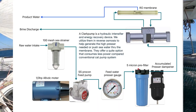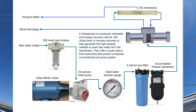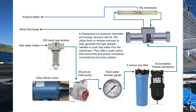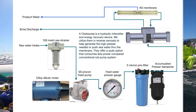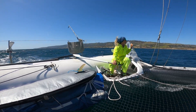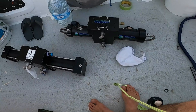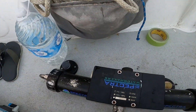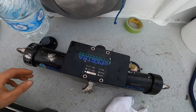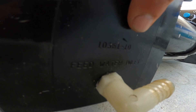It's time for Tritium to get a water maker. This magical device filters the salt out of the seawater using a reverse osmosis membrane. We've decided to go with a Clark pump system on Tritium's water maker install. If you're not familiar with the basics of the Clark pump system, maybe familiarize yourself first because James gets pretty in-depth here. What we have here is a Spectra 10% Clark pump — how you know it's a 10% is right where the inlet is, there is a dash 10.